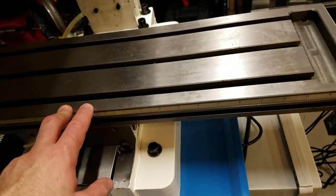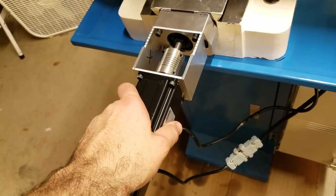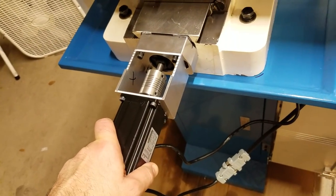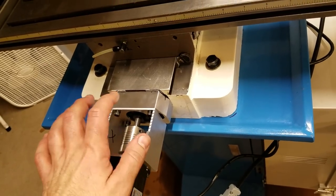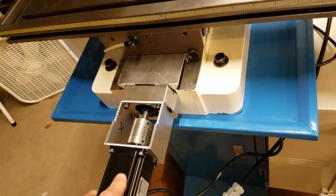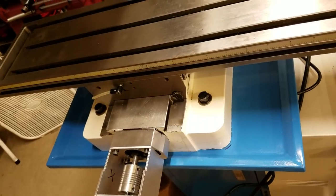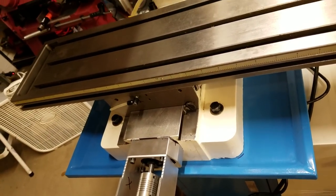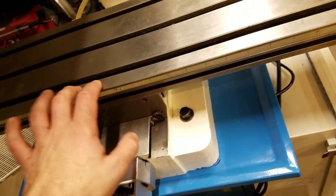Motion of the machine is really smooth. These closed loop lead shine knockoff copies — I'm able to set these to 2,000 pulses per rev. With these 12mm ball screws at 4mm pitch and 2,000 pulses per rev, it works out to about 12,700 pulses per inch. So that takes the minimum increment well below one-thousandth of an inch, and the motion is really smooth.